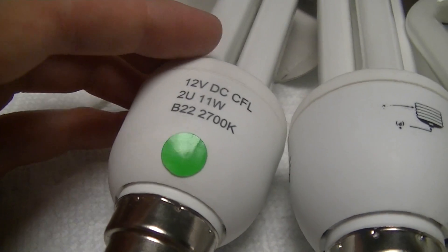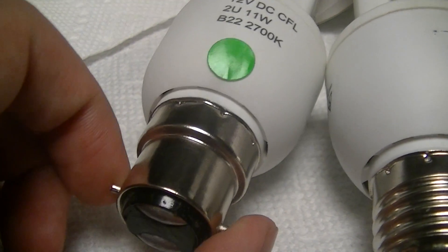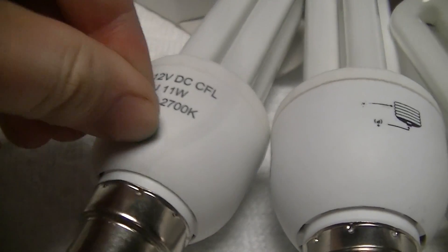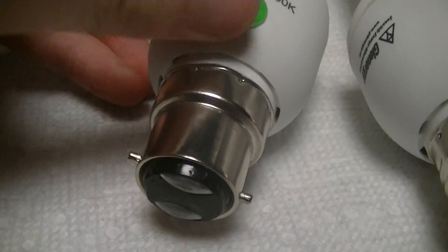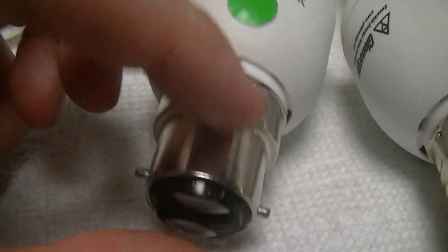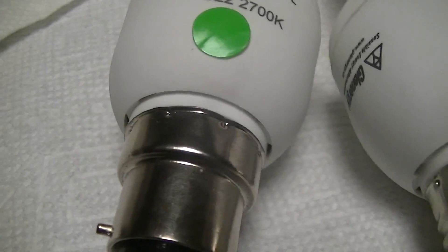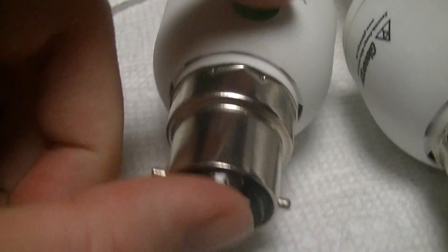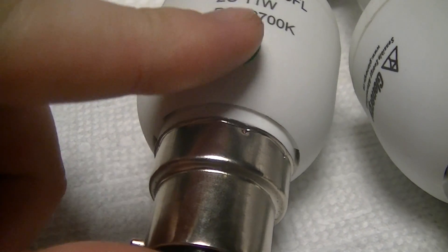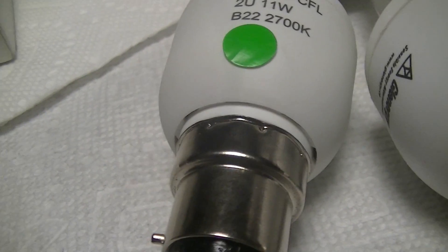It's also advantageous in lamps like this which are dual contact medium bayonet based, which is an inherently unpolarized type of lamp base. There was a green sticker on the lamp base next to the positive terminal, which I just moved up to the lamp ballast housing so it wouldn't get in the way — probably because this seems prone to falling off in that pictorial location.